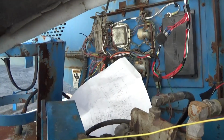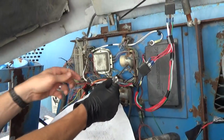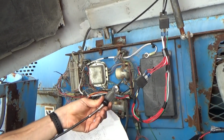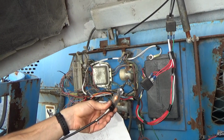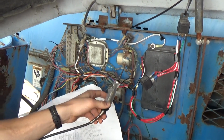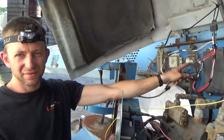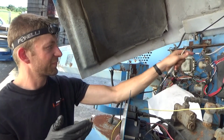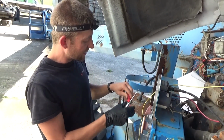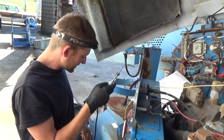Let's see. I'm going to go test light to battery negative now. So this should light up to power on this relay. Ready? Boom. When we lose the power feed on this control side wire, the engine shuts off. Now, can we do a little bypass test, keep this relay powered up just with a test light, and see if this thing will stay running?